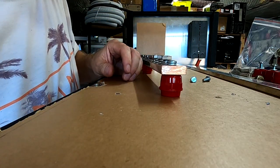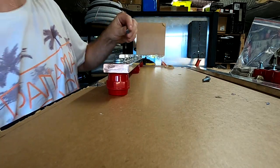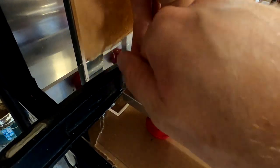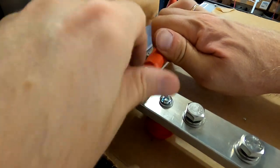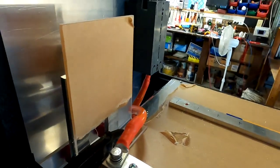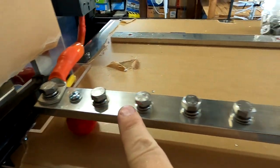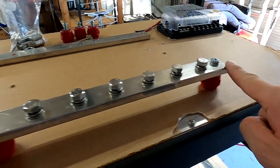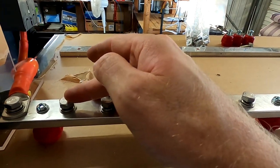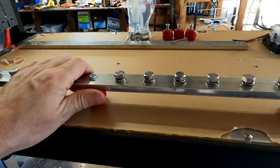Okay, let's do a little test and see if it fits. I have to take off the protection film sticker anyway at some stage. Now we can connect the first cable here — just temporarily, just for the joy of doing it. This will be our incoming cable from the breaker, coming from the bus bars from the battery banks. Then we've got the distribution bus bar up here. These connections will be for the charge controllers and these ones for the load. At the moment we've got only one inverter connected, so everything else is future — but we've got the possibility. Nice, sturdy 650 amp bus bar.